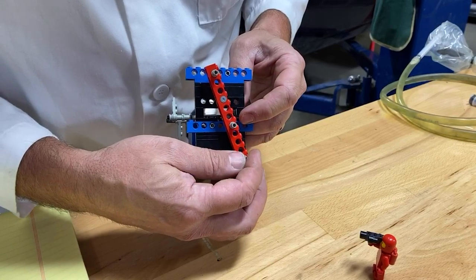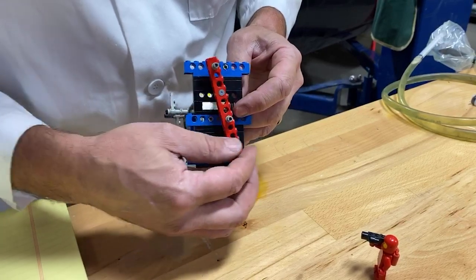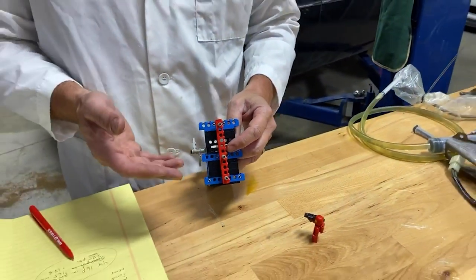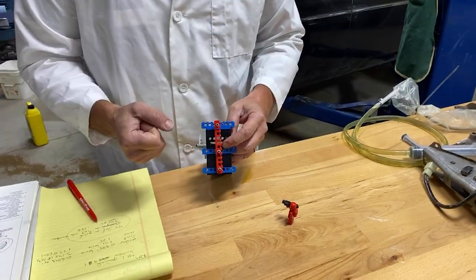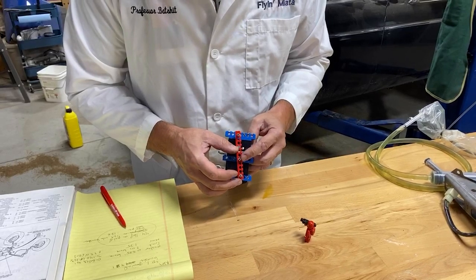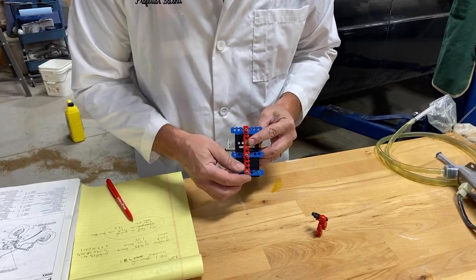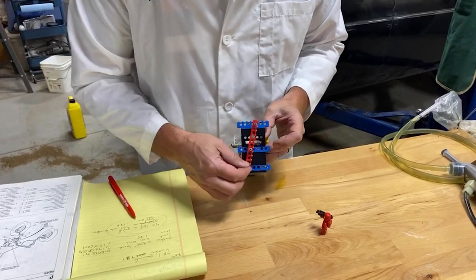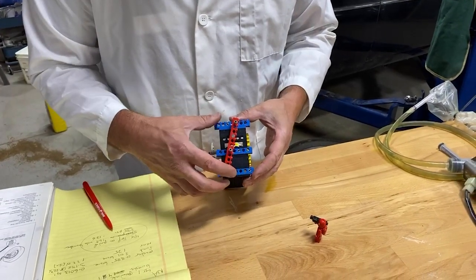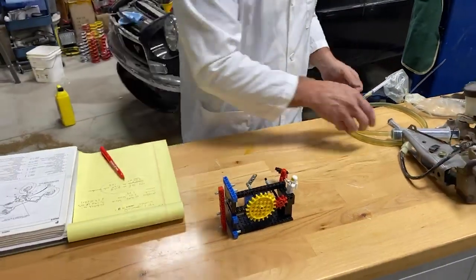With three pounds of force here, you'll end up with seven pounds on the other end because of the lever multiplication. Leverage is something we all understand — if you can't move something, you get a longer pry bar or put a cheater pipe over your jack handle. It works both halfway up the lever or on the other side of the pivot. This is basically a direct equivalent to gearing — you're trading off distance for force multiplication.